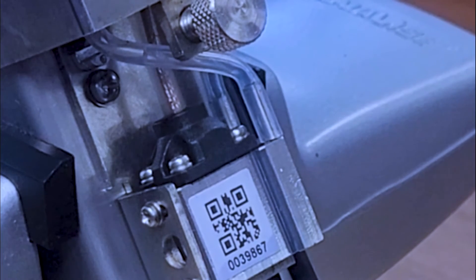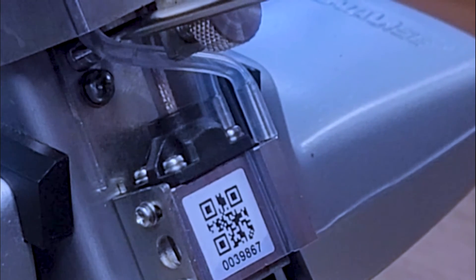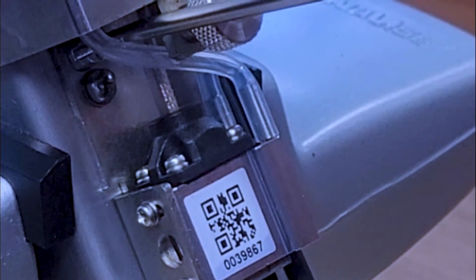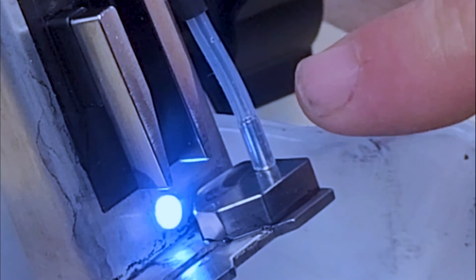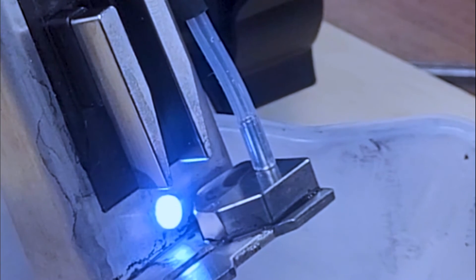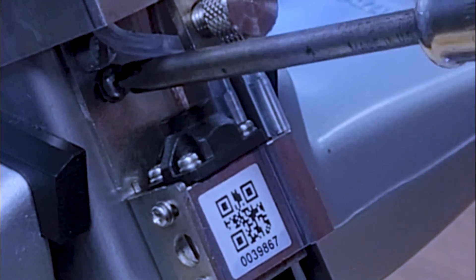My stream will start again between 40 and 46 percent, so I'm going to be ready for when the stream happens. As you can see, I was going right into the hole. I was getting some fluid coming up here — we're not going to get a lot because we're not using the pressure from the pump, we're using the pressure from our Venturi. I'm going to wait for the second stream at 78 percent just to verify, and I can see that I'm in the hole. So I'm going to go ahead and tighten up this screw here, locking my cam into place.